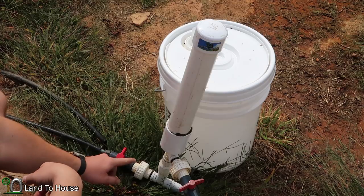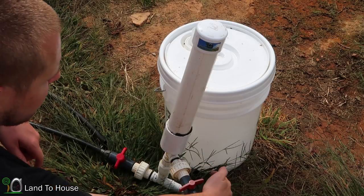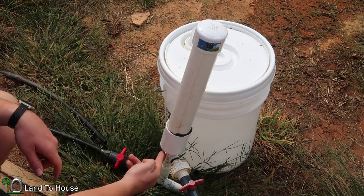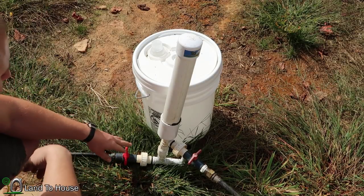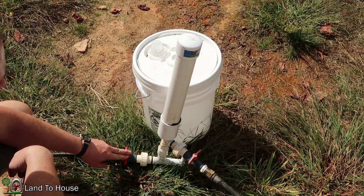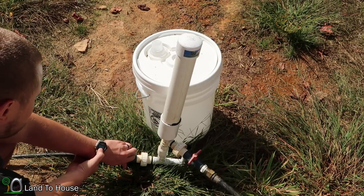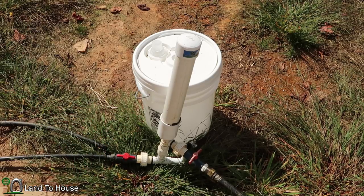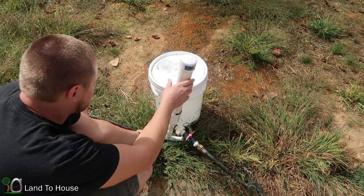On this pump the drive pipe comes in through the bottom just like the previous version. Then the water continues through and hits the check valve on this side. When the pressure wave happens it comes back up into the pressure tank and then out the delivery pipe. Just like with the other pump, I have my bucket full and the delivery pipe closed, timing how long it takes to empty the five gallon bucket. The time is 4:25 — that's when I heard it gulp its first gulp of air.